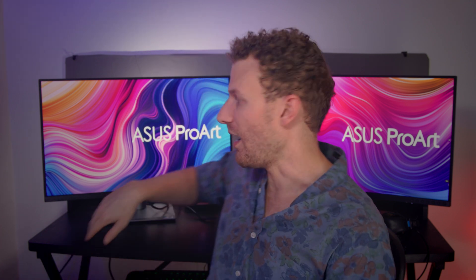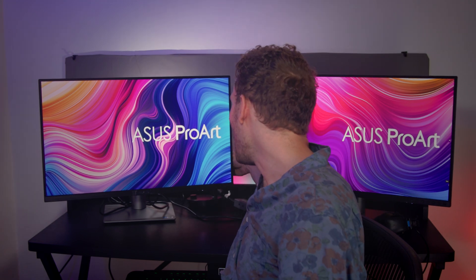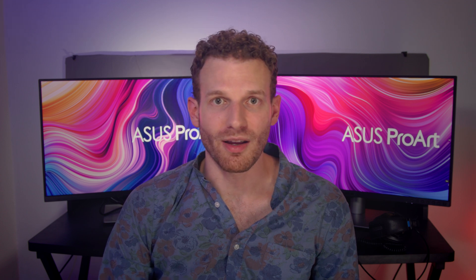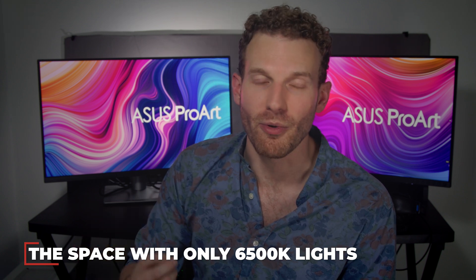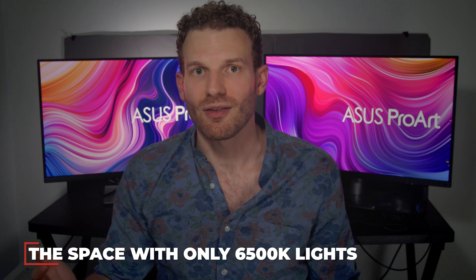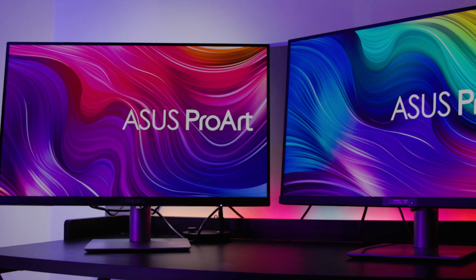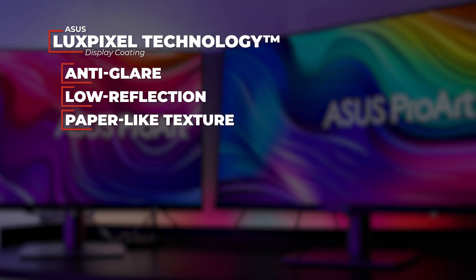Other notes on my workspace: I have an I/O device to ensure a clean and accurate video feed to the monitors. I have a 6500K bias light behind the reference monitor and a middle gray backdrop. The bias light helps ease eye fatigue compared to working in the dark, while the 6500K color temperature and gray backdrop help minimize ambient colors affecting how the human eye perceives color. When Calman engineers certify devices for color accuracy, it is in an environment similar to this. If you need more ambient light, keep it to 6500K — dim and not positioned to create glare on your reference monitor. Fortunately, the ProArt PA278CFRV uses ASUS's LuxPixel technology, touted as anti-glare with low reflection.